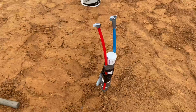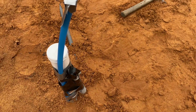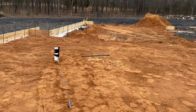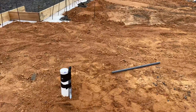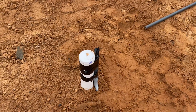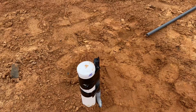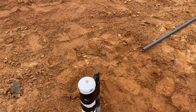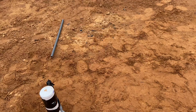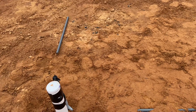The second thing is the kitchen island electrical. This is the kitchen island area — I'm standing in front of the sink — and I want the electric to stub up right behind those pipes into the back side of the cabinetry, then shoot all the way over to that plumbing wall. That three-inch waste pipe feeds upstairs, and I just strapped the conduit right to that. It'll go inside a wall with a junction box to tie into the kitchen circuits. That's important and it's code: if you've got a kitchen island it has to tie into one of the two dedicated kitchen 20-amp receptacle branches.